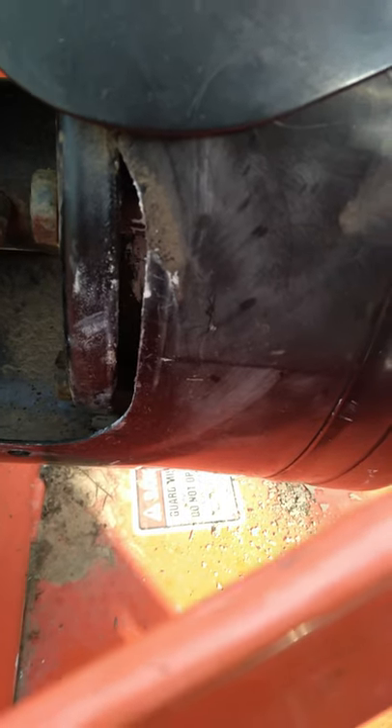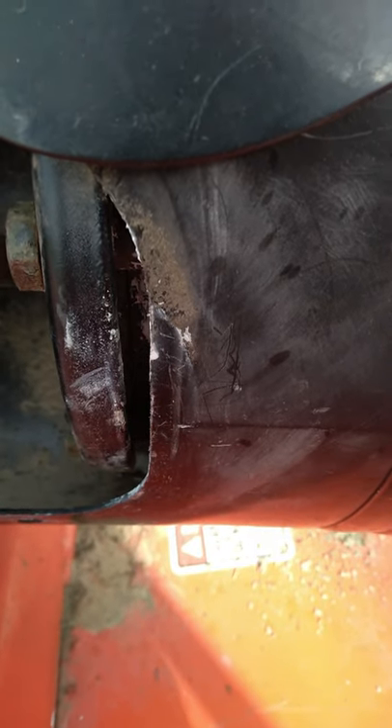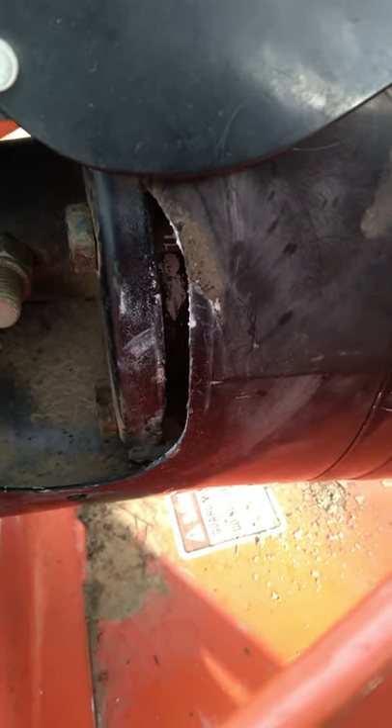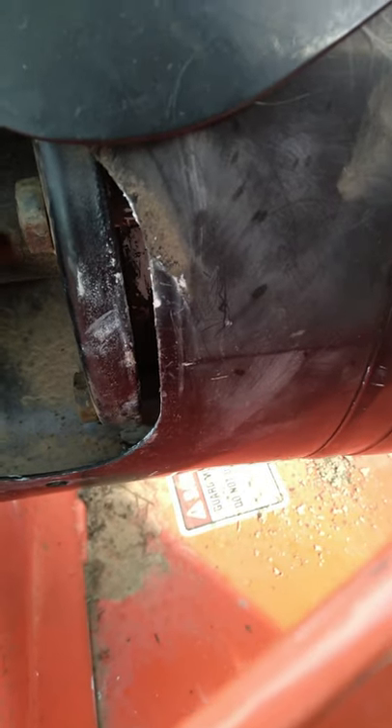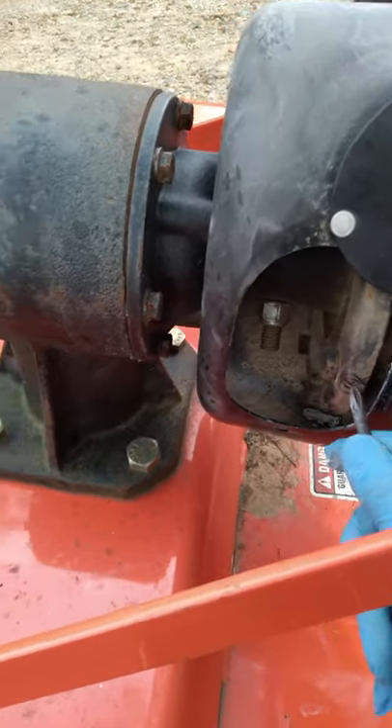It's a little hard to see, but you can see the plate on the outside — they didn't make the access cover large enough. Between the two pressure plates you can see the clutches. They look like one solid unit in there. I put some white paint on them so when I do the slip, I can make sure it slips. The paint will be in two different places, hopefully, if it works. I'll mark the bolt that I'm starting with so that I'll know when I get back around to it.